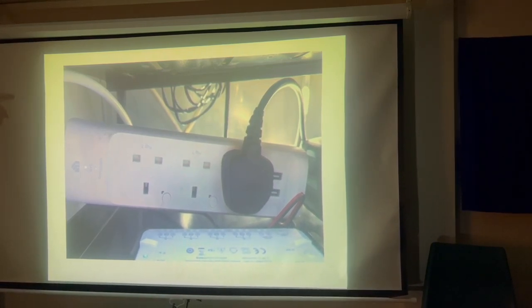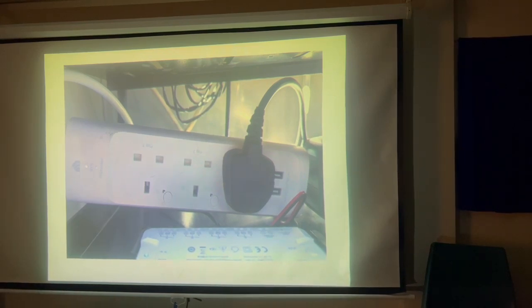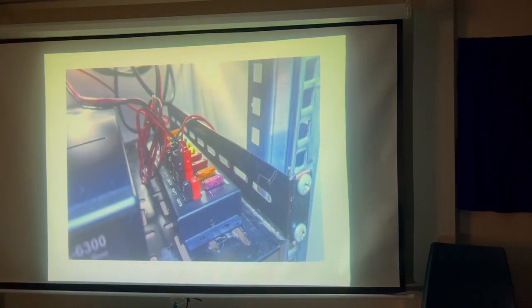Plug number 1 there is actually connected up to a 13.8 volt power supply. So when I'm not using the station, I can just disable the power supply and everything's turned off. That power supply is hooked up to this multi-way power pole distribution, which feeds the radio and it feeds the ATU up on the mast and a few other little bits in there.